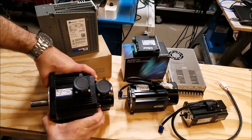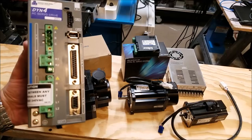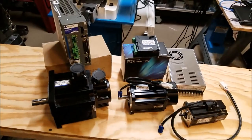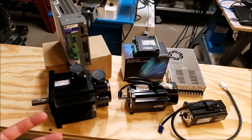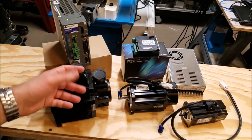One of the things that's really cool about this is it has an encoder in it, and this drive has an encoder output. I'm going to take that output and wire it directly into the encoder input on the Centroid Acorn motion controller board. That's going to give me full spindle feedback on my milling machine, which lets you do things like rigid tapping and boring cycles where you can position the boring tip on exit. On a lathe, it'd be a super huge bang for the buck — once you have precision spindle feedback you can do single point threading, rigid tapping, and all that stuff.